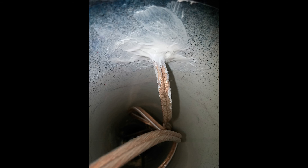Notice the offset in the wires going to the high-frequency driver, so that if I ever disconnect them and have to reconnect again, I can tell easily which way they go — which is plus and which is minus. I wrote down a reminder somewhere as well. On the inside of the four-inch tube, I added some extra silicon sealer around where the wire extends through, to make sure there's a good seal. I used the black sealer on the outside — I had some black silicon windshield sealer — and it didn't show up at all against the dark blue background.